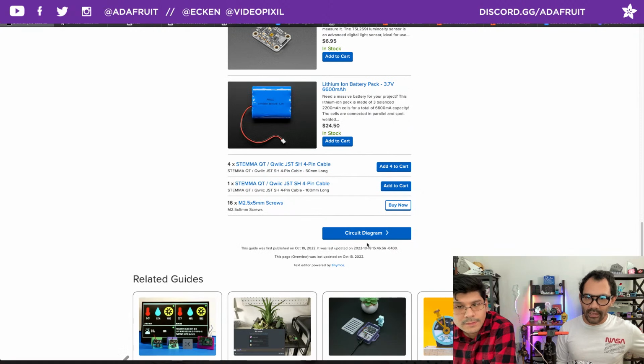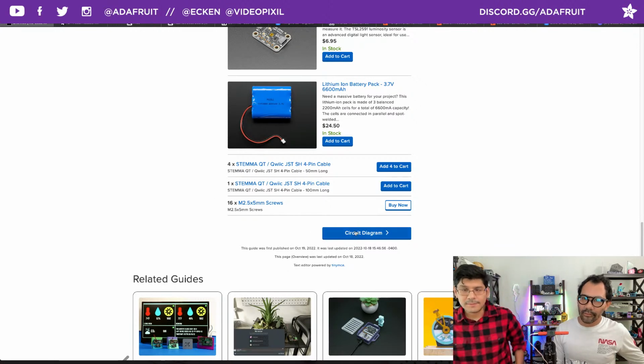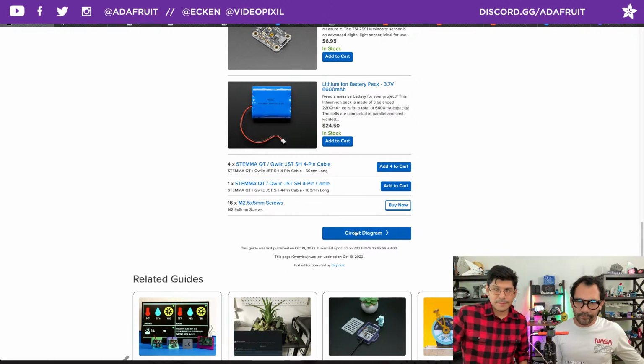They're in stock. Yep, and then we're just using the M2.5 by 5 millimeter long screws to mount everything together. Yeah, the metal ones. Don't use plastic ones. You're going to tap some plastic. You're going to mess up the plastic on plastic. Exactly. All right. Ready to move on?